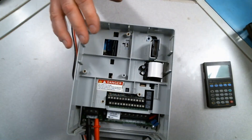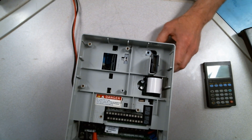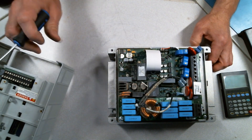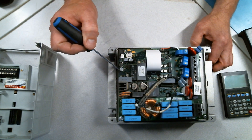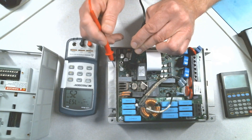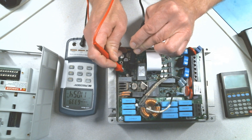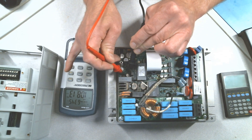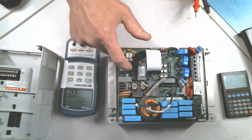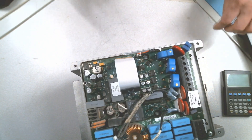We open up the cover and we are talking about this area here. The SMD capacitors — usually it's only one capacitor, 47uF, 35V — this one measures low: just 100 nanofarad and 600 ohm ESR. So this one would be the one to replace in this case.